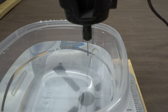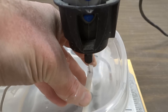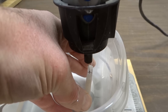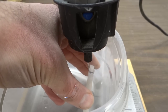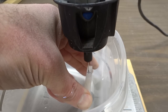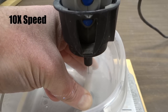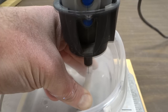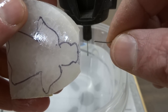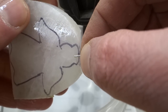I'm going to be cutting in water to keep the drill bit cool. So the first thing is to line everything up — I kind of look at it from both sides. Trying to look through the water just distorts everything. I think that's where I want it. I'm going to check the depth with an old drill bit — I think I've got about enough depth there.